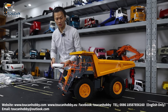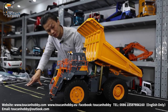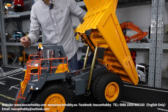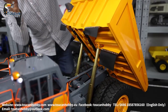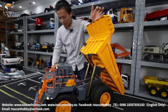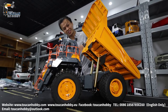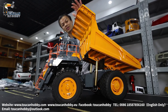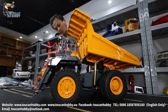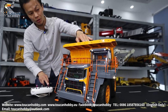I will lift up. One small issue: this one has a two-stage multiple-level cylinder for lifting up the bucket. So at the beginning it is a little bit shaking because the cylinder has resistance. Without loading, without heavy cargo, it will shake a little. Going down is the same — a little bit stuck because of resistance from the cylinder. But if you have some weight or cargo on it, it will be more smooth and also less shaking when rising.